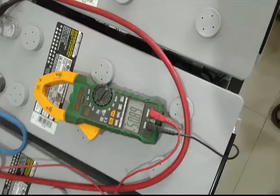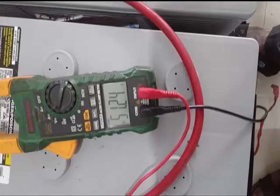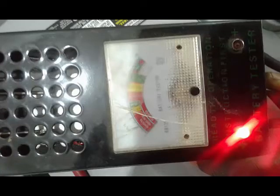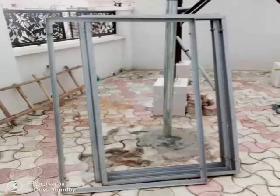Now we are testing the voltage of the battery. We have 50.89 volts — that comes to around 12.7 volts per battery. This is while the battery is working under load. If the battery is not good while delivering load, the voltage will be lower than this. The green indicator shows the battery is okay; yellow shows the battery is getting weaker; red shows the battery is bad; and the lower red shows the battery needs replacement.